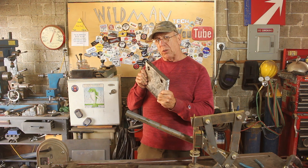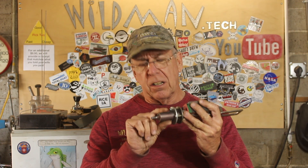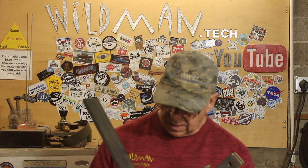The new rendition is going to be made around this piece of 1-inch plate steel. One of the things I think was a flaw in my logic was using this linear bearing — the idea has its good points, but I think there's room for improvement. The improvement should be to have the entire barrel sliding inside a tube. I'm going to remove this socket from the old one because I think we can still use it.